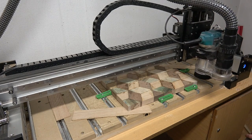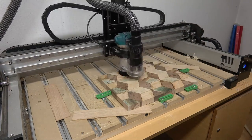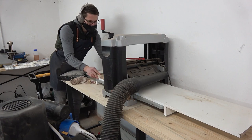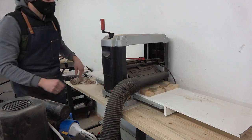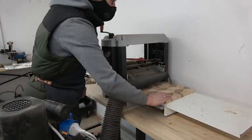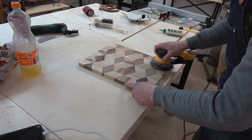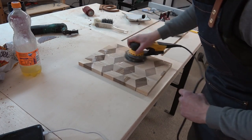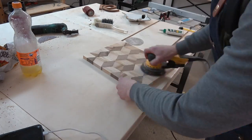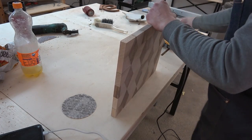Next came flattening one surface with my trusty ShapeOko CNC, and after that I let the opposite side go through my planer — both tools in combination really make quick work of this procedure. The board still had some tiny gaps where the glue-up wasn't 100% perfect, so I rubbed some Titebond into those gaps and sanded with 80-grit without the random orbital attached to my shop vac. This way I was able to fill all the gaps with extremely fine wood dust.